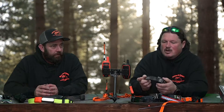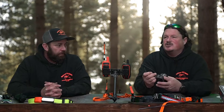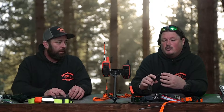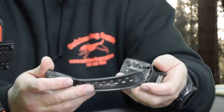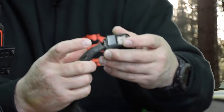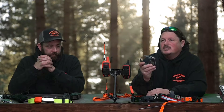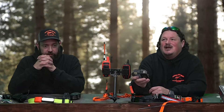You can see the difference between collar generations. That's a first-generation collar — you can see how the rubber is absolutely falling apart. This is a second-generation, but the rubber was also ripped — it could have been a hog or a multitude of things — you can see where it ripped at the base and there's a gap. If this wire gets broken, these collars no longer work — that is the biggest problem we have with the TT15. It's very important to tell people not to grab dogs by the collars when loading them in the box, and don't hook leashes onto those collars. There's a reason they do not have D-rings on them.